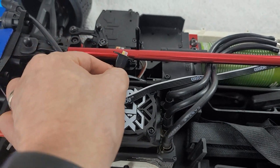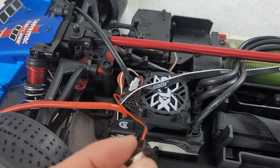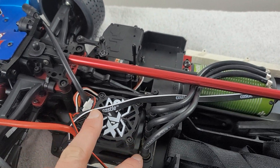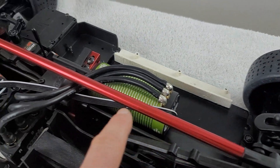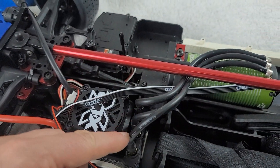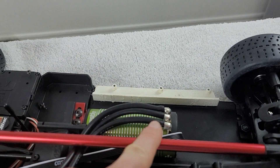My personal preference is to either fasten the switch here or to just cut and solder it so that it's permanently on. The other couple of wires that exit from the speed control go directly to the motor — we have our sensor wire that goes to the back side of our brushless motor, and we have our big heavy-duty eight-gauge leads that go from the back of the speed control to the top side of our motor.